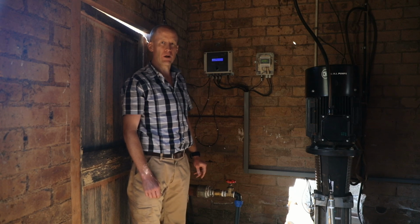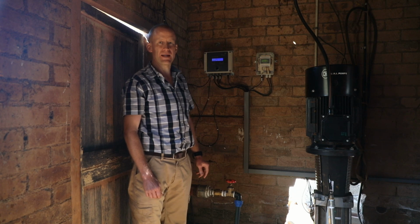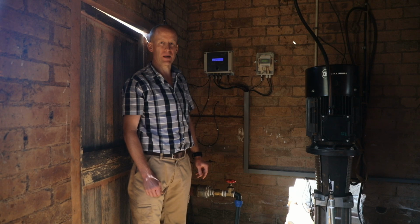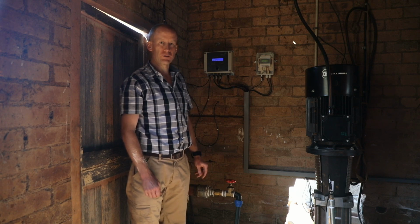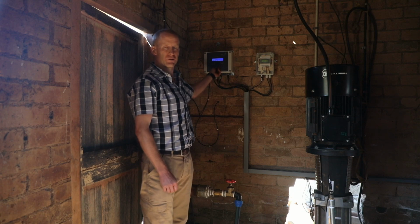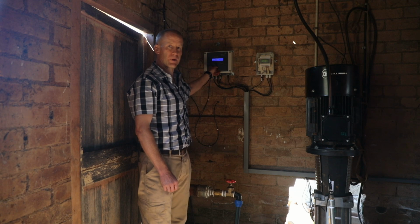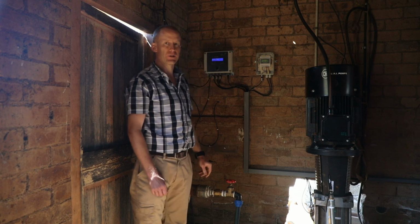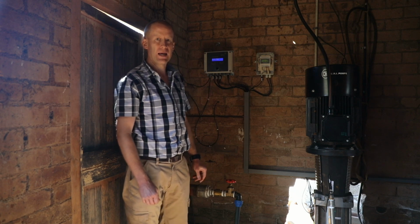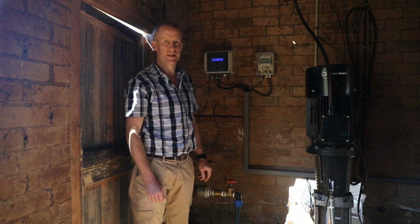It now forces the operator to come to the pump house and inspect why the inlet has got blocked, and then unblock the inlet before restarting the pump. To restart the pump, the operator must cycle the switch to off to clear the trip condition, and then put the switch back on again to get the pump to restart. You can now hear the pump starting up again, and now I need to open up the valve so that it won't discover a blocked inlet.